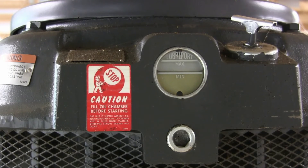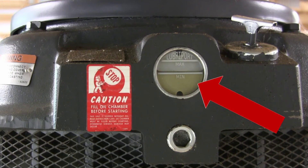One of the things you also want to look at during your walk around is your oil level in your motors. That oil line should be just above middle — if it's lower than that, it needs to be added, and you will uncover the bearing and make that motor fail. Most motors have a sight glass for the oil level for the upper bearing. There are a few manufacturers that do not have them and use grease fittings at the top. The oil that goes in these motors is a specialty oil called RO oil — it has rust inhibitors and oxidation inhibitors in it. If the oil needs to be changed, which should be done once a year, give us a call and we'll get that as part of your service.